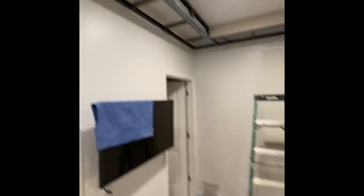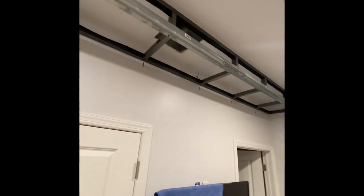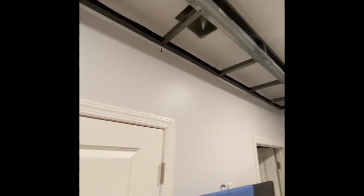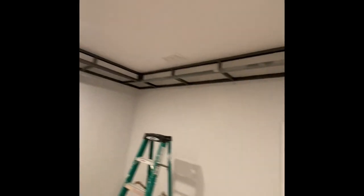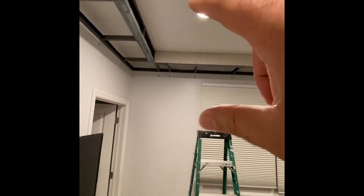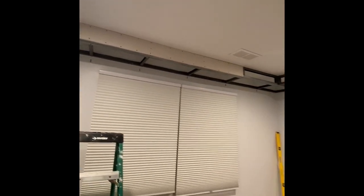After framing the box, as I said in the first part of the video, I measured six inches from the ceiling down, and then from here to here sixteen inches, and I snapped a line on the top of the ceiling. Then I started framing. I've already framed this — this is the box all around the master bedroom ceiling. You can see over there I start to box it with the sheetrock, six inches width, and you go down and screw them to the studs.